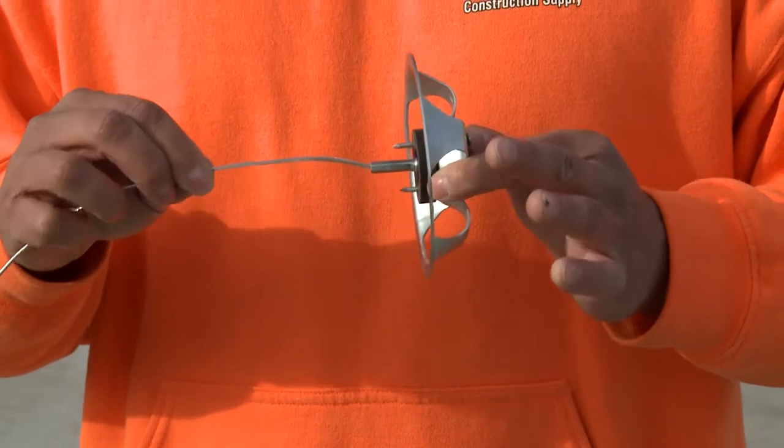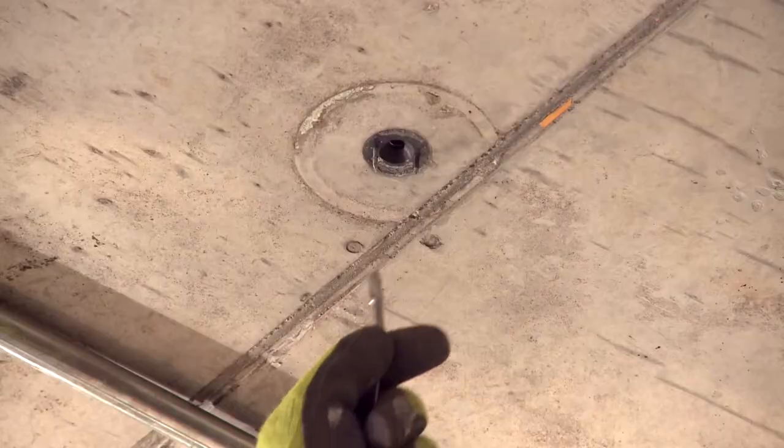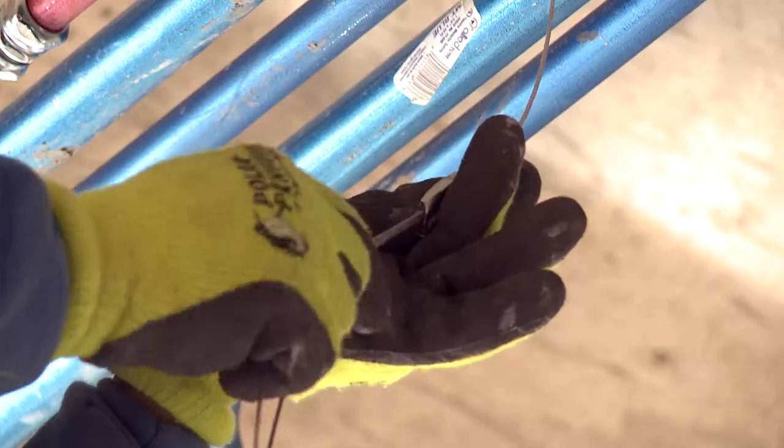It's a great product and it's that easy. The main differences I see between the Gripples and threaded rod is there's a lot of waste and time consumption as far as labor hours — getting down out of a lift, cutting up a bunch of stuff. With the Gripples, they give you a little handle and you just cut the remainder. I leave a little extra in case I need to make an adjustment, like six to seven inches, but if you're throwing anything away it's just a little thin wire, not all this all-thread. When you really think about it, over the course of a ten million dollar job you're throwing away half a mile of all-thread.